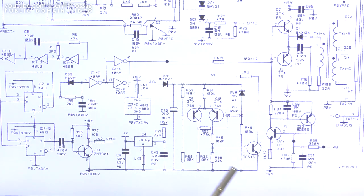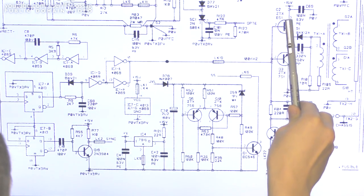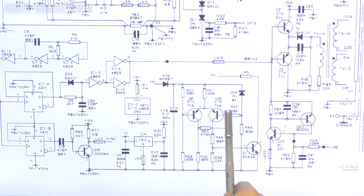Now I've measured around a fair bit in this circuit, and most of the resistors seem to be okay. They're jelly bean anyway, so I can replace them when I've got all the parts ordered and can troubleshoot it. And all the diodes actually seem to be okay, which is very good, because they're kind of weird, not your standard diodes. They're some really fast things, so I'd probably have to put some TO220 switching diodes in there instead, because I can't really get them. So I'm hoping we're gonna be able to fix this thing by replacing this guy, just for good measure, because I'm ordering them.